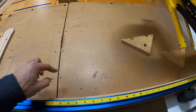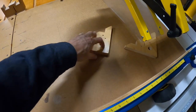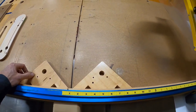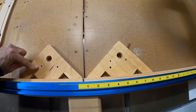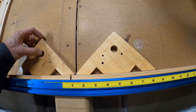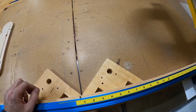The other day I did have to make some angled cuts, and you can see writing on the sled. These marks here are angles. I used my cabinet squares and assembly squares to cut my 45-degree cuts. I screwed right there and made these holes a little bit big so I could adjust it to be absolutely perfect. I wanted to make sure the kerf was in the right spot. Once you do that, it's nice — I was able to make really nice 45-degree cuts with just using these. It's so simple and it worked great.